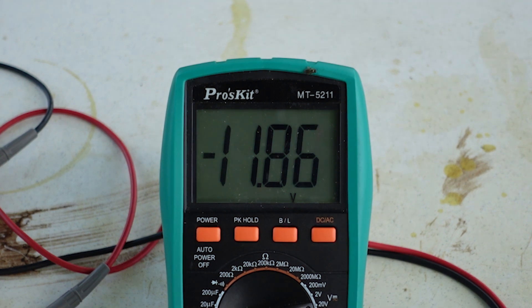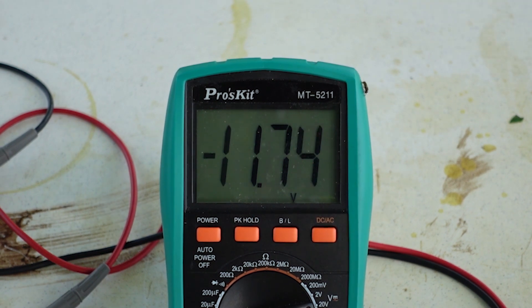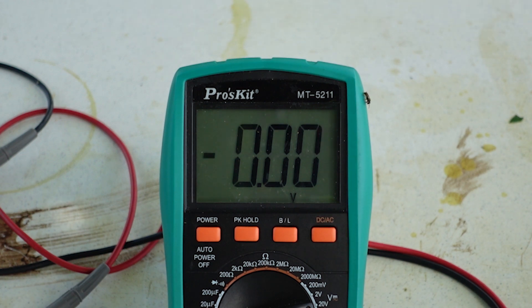Let's take it back off. Now we're getting even better. KN4YCD test, national call, one two three four. The radio is sitting on the table — I don't even want to turn it. KN4YCD test, one two three four. So that's showing that we're getting more RF without the tiger tail attached. I haven't been able to consistently get it to show me better power output with the tiger tail on.